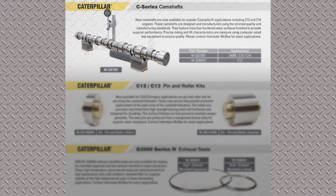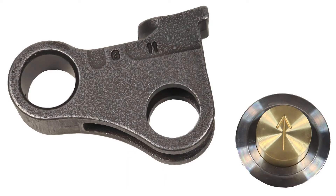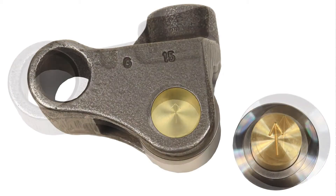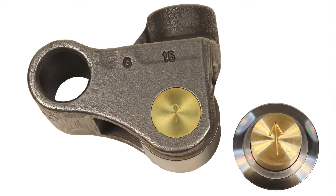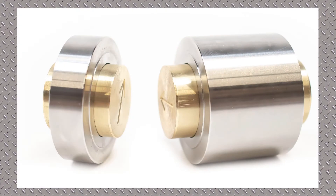The next item is the C12 and C13 cam roller and pin, which are now available from stock. You can see a picture of one disassembled here. This is the valve arm — the valve arm is not drilled, but the injector arm is drilled, and that little arrow helps orient the oiling hole for the axle pin. The rollers are all made in the States, made from 8620 hardened bearing steel, and the pins are made from a manganese bronze alloy.